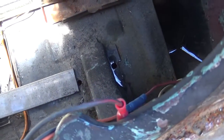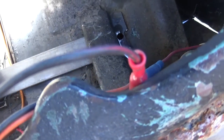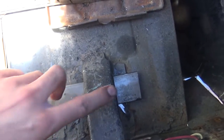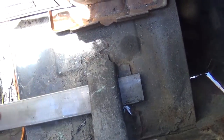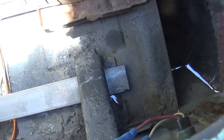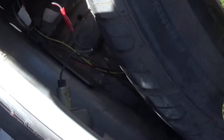Got this side done. I've got my quarter inch plate — it's going to go through like that. I'm going to transfer these two holes before I go in, and then I can set them up in the drill press and drill these out real quick. Cut this down — I don't have enough for both sides, and I haven't started on this side yet, but this side should be pretty easy.